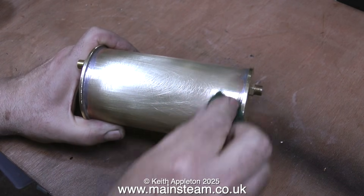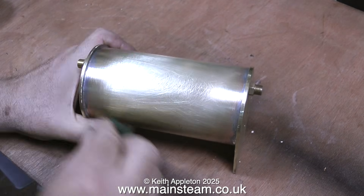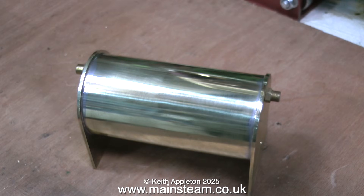Now it's time for the big cleanup. I don't think I'm going to paint this condenser, so I need it to look fairly pretty — even though it's going to fit right down in the bottom of the boat. I clean it first with emery cloth, then a piece of scotch bright, and then polish it using the polishing spindle. I don't really need to clean it to this extent, but you must admit it looks a lot better than it did when I was soldering it.